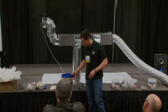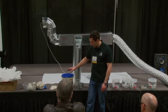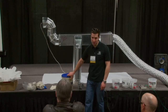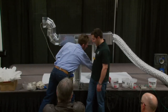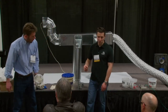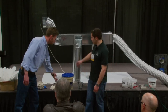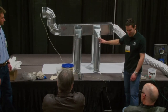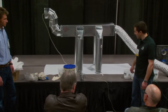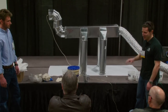The mastic is actually a quicker option for the trades. They have different types. This is a number six mastic and this is a thicker mastic. We need this because we have big holes today. A lower number you could basically use a paintbrush to paint on. Here we've deliberately made our ductwork very leaky, so you'll see some gaps. We'll give you gloves, we're going to give you a suit, so you can go nuts.